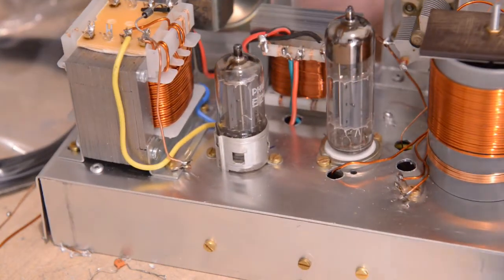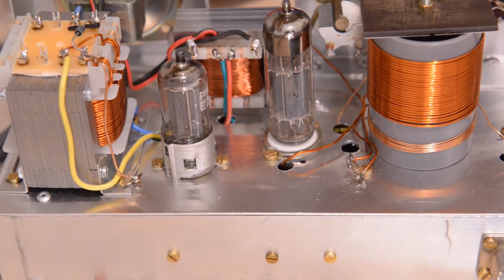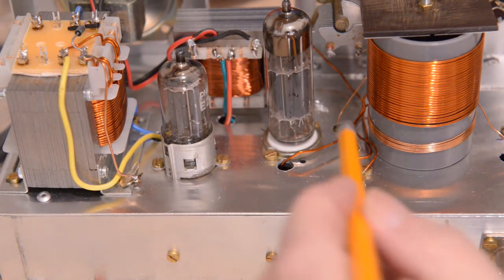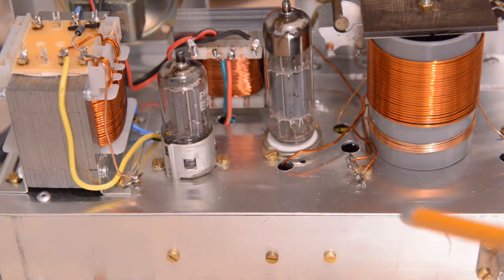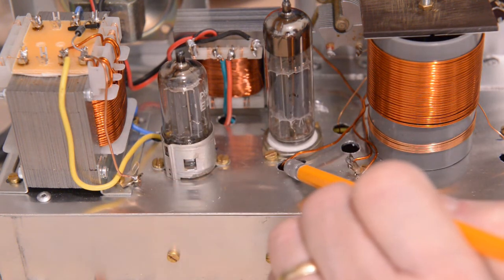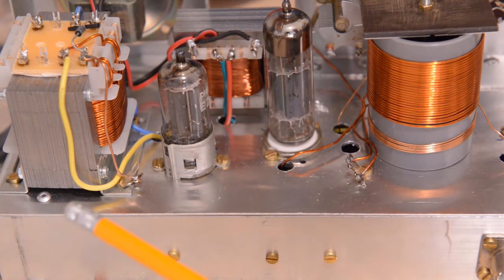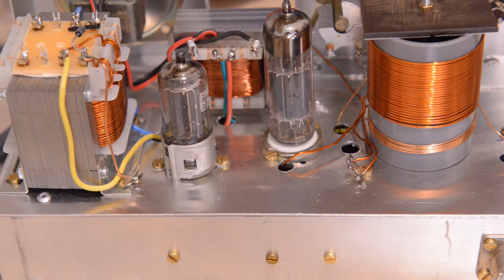So that the wire goes over the top and not going to... so you see what I mean? If you position it right, you can see that. Anyway guys, you can see it here. Normally this wire went over to this hole, went underneath and on to pin 8. And then I put it straight on there, so you have the protection now from the chassis, and it won't influence anything anymore. So tonight I will have another go at this radio, and hopefully I can record some signals onto the video. That's what I want to do, so you can hear it.